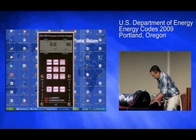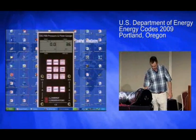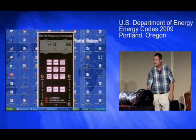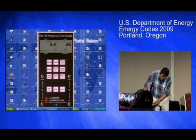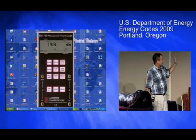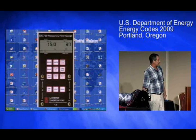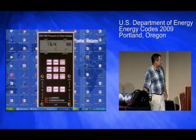This is a really common mistake when you test duct leakage — not connecting the hoses. Did that on purpose. So I'm going to bring this up to 25 pascals on the left-hand side, and because I've programmed this ultra-smart manometer, it's going to tell us what the leakage is.